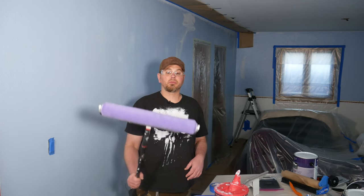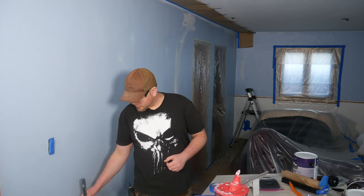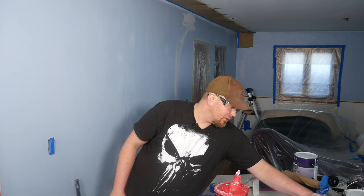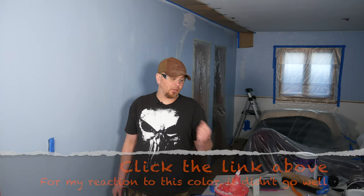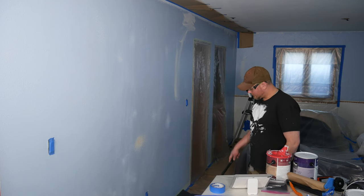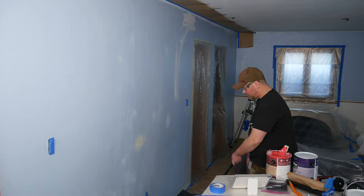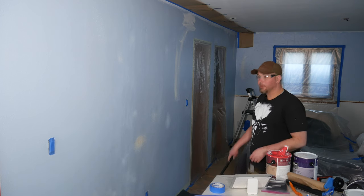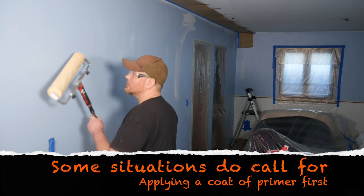We're just about ready to start painting the walls. I'm using an extra-wide 18-inch roller pad instead of the standard 9-inch — it's twice as wide so you get it done twice as fast. They are a little more expensive but the time savings is worth it. The color we're doing is called Honey Nougat, picked up at Home Depot. For the first coat, you don't necessarily have to worry about getting complete total coverage — if a spot is a little thin, you'll get it on the second coat. Good quality paint and primer in one should cover well with two coats.